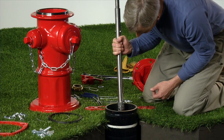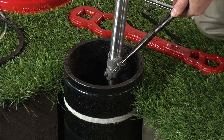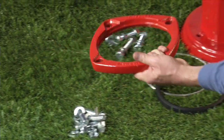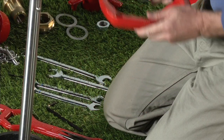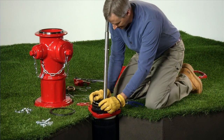Reconnect the upper stem rod to the lower stem rod with the new coupler pins, new breakable stem rod coupling, and secure with spring pins. Slide a new breakable flange over the lower barrel. Be sure the breakable flange is right side up, indicated with the text 'this side up.' Then install a new lock ring under the groove of the lower barrel.